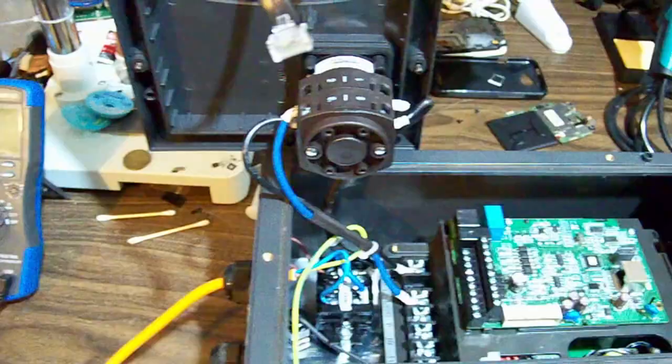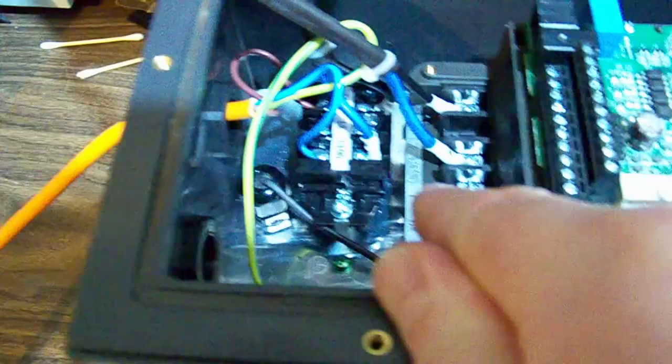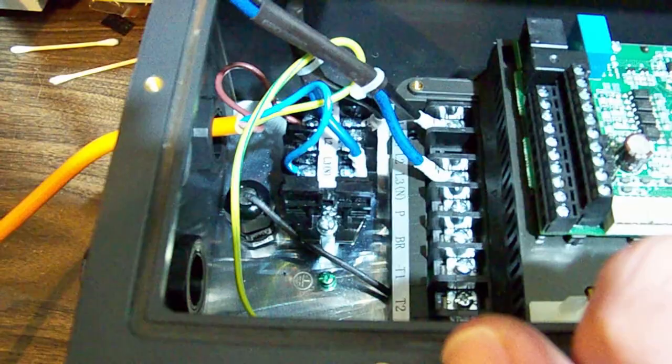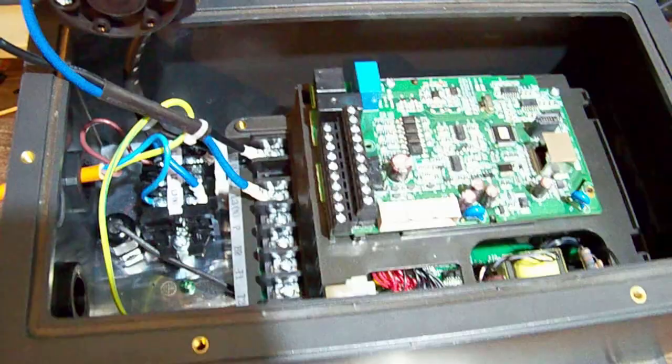It's kind of not an RJ45 but it could actually be RJ45. Here's our main switch, and that comes in from down there. That's just a junction block — I don't think it does anything other than pass through. We'll need to check our switch first. Do we have mains coming in on this side? Probe down on here... and we get 233V, so that's good — switch is working.